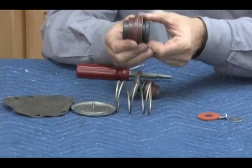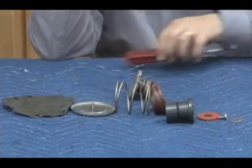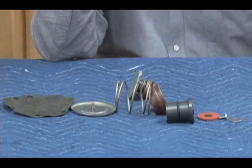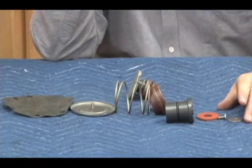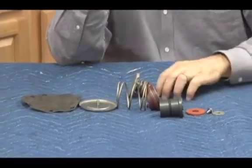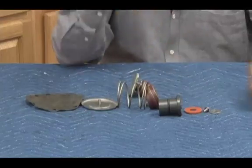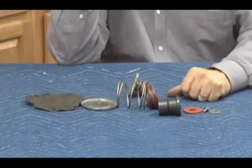Now, we talked earlier about the different properties of rubber, and you can see the color of the rubber there is that black type of rubber, that Buna N family, if you will, of types of rubbers: EPDM, nitrile, those kind of names that the black rubber is. But the thing with the black rubber that we remember from our discussion on rubber is that the black rubber reacts to different things, being water quality and/or temperature, and that reaction is usually a swelling.